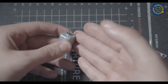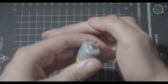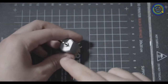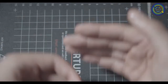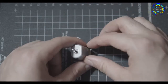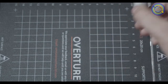You can't control the speed unless you use a technique called pulsing, where, for example, if you have 1 second where you're running the motor, 50% of it should be off, 50% of it should be on at tiny little increments, and then doing that, you can keep it at 50% speed, because you're only giving it 50% power, and it averages at 50%. But you really don't get much with these. They're kind of just turn on something like a fan that's cooling a room or AC or whatever, and then turn it off when you're done.